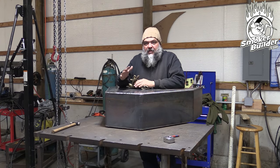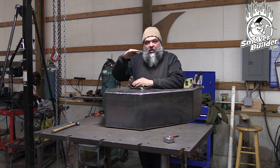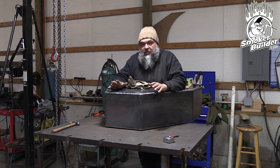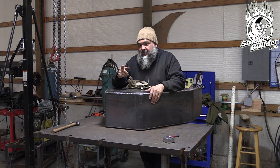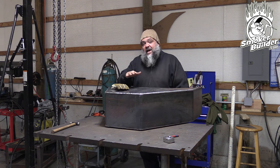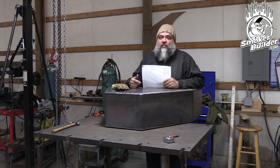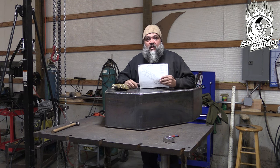Welding is concluded. Next step: take this to the tank, find the cooking grate height, use that measurement to split and lay out the cut lines on the tank. It'll probably start undersized until we slowly fit the collector in. Plans for this entire 1,000 gallon build are available at smokerplans.net, with over 240 different smoker designs to choose from or follow along with this build.